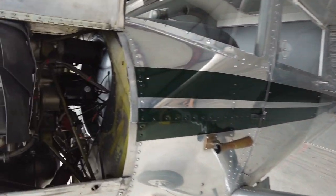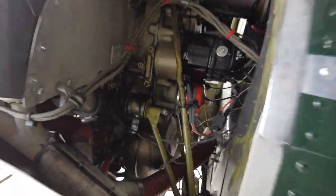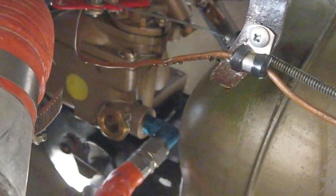Now let's take a look at this actual carburetor. Here's the engine — if we look down there, you see that little guy? That's the carburetor. That copper line running down is your primer. And then that red lever is the quote-unquote mixture control. It doesn't actually control mixture — it controls the ambient pressure inside the carburetor. So you can kind of trick the auto-compensating system if you want it leaner or richer. It really doesn't do a whole lot of work under 5,000 feet.